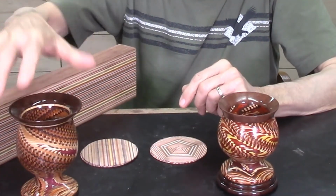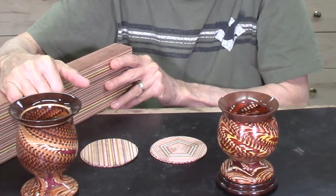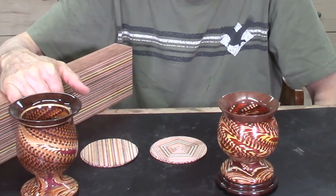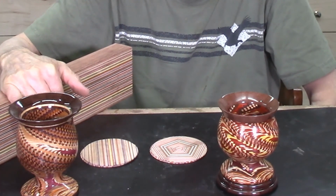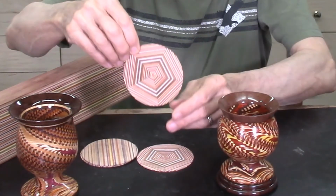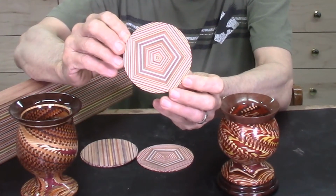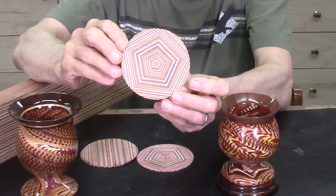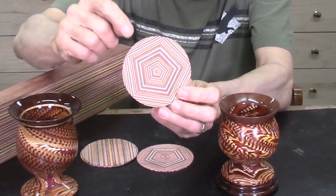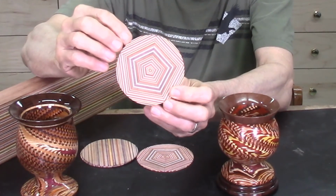bowl. And I accomplished this by making a laminated board with 39 strips of contrasting colors, and then cutting these on my Accu-Slice system into 5 wedges. And then from these 5 wedges, producing my disc. It's a combination of the Dizzy Bowl pattern and the segmented wedge techniques. And in doing this, I see more of these outer layers and less of the inner layers of my board.